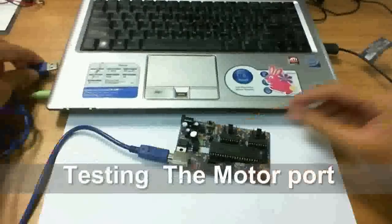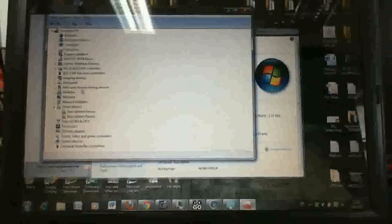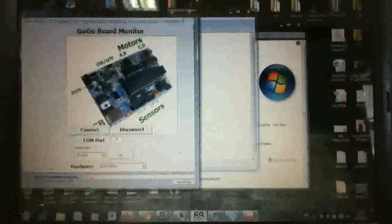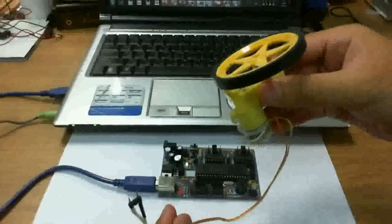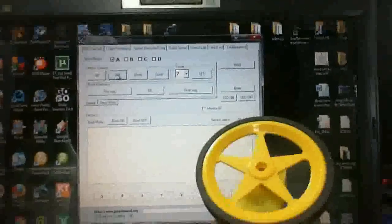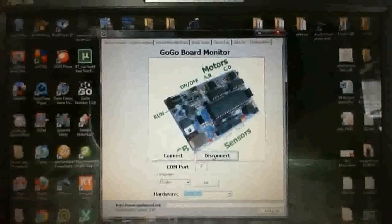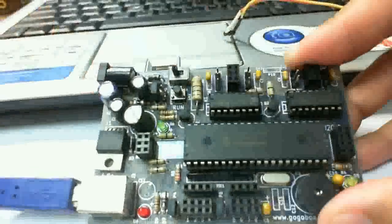For the test, you need to use a computer. We will connect the GoGo board to the computer through a USB cable and control the motors using the GoGo Monitor software. To connect to the GoGo board, you first need to look at the COM port number, like we've done before. Once you're connected, try to put a motor on one of the motor ports — for example, here we're connecting it to motor A. You can control the motor by clicking on the A port and then clicking the ON button, which should make the motor spin. You can change the direction by pressing the RD button and change the power level to see if the motor works the way it should. If that's working, it means your motor port is properly functioning, and you should test all the remaining ports as well. That concludes the assembly process of the GoGo board. Thank you for watching, and I hope the GoGo board is useful in your projects.